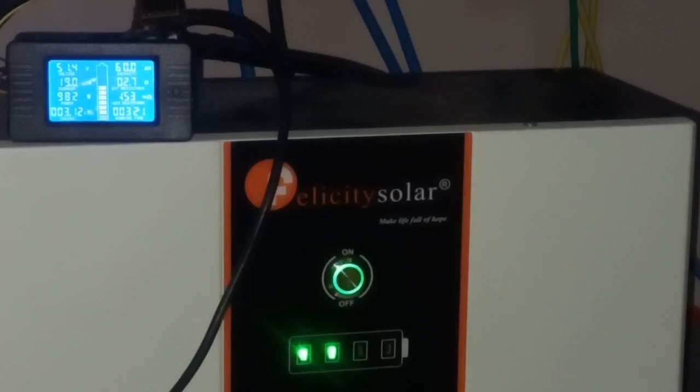The first bar went off around 20 amp hour. The second bar went up around 41 amp hour. So definitely I was thinking the third bar would go up at about 60 point something amp hour. 60 amp hour. Battery status bar is still 2. This 2 doesn't mean 50%, it means less than 50%. 62 amp hour. The battery capacity bar on the battery is still 2 bars.